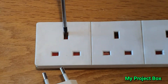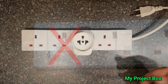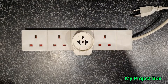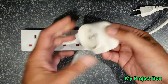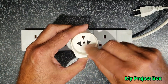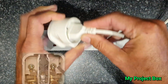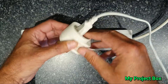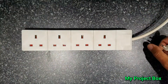Now you might have seen one of these little tricks that people do, which is considered unsafe and I would agree — I cannot endorse it. But from an electrical standpoint it's probably safer than using one of these adapters, because this is another point of weakness. You have electrical connections in there, then you have these flimsy bits of metal made out of who knows what from China that have to make connection, and they're very flimsy, they never make a good connection, they arc, and it's really not very good.